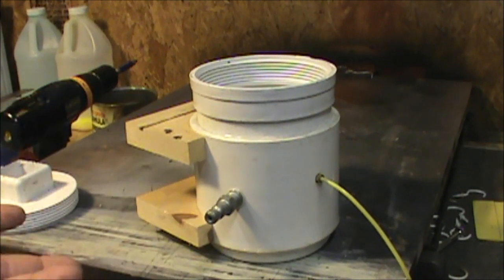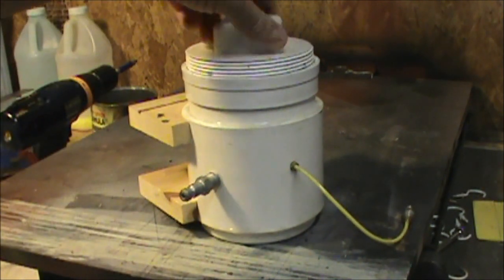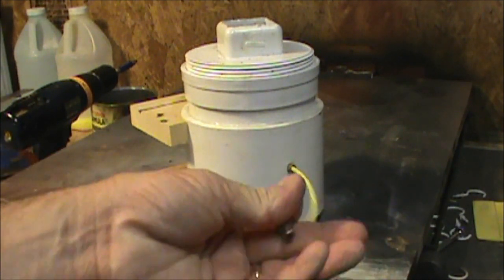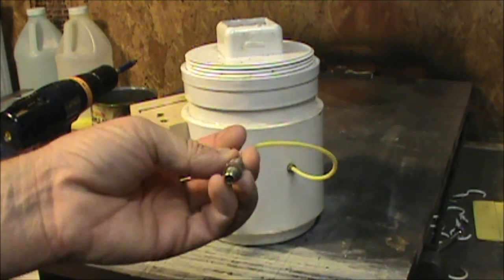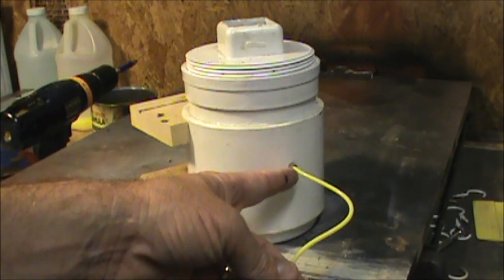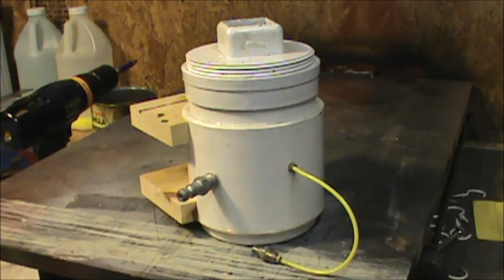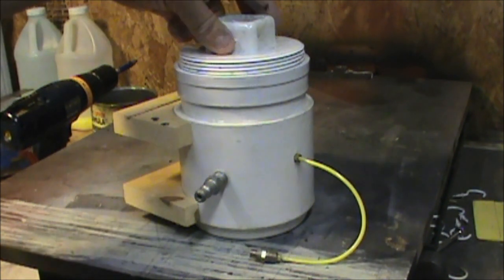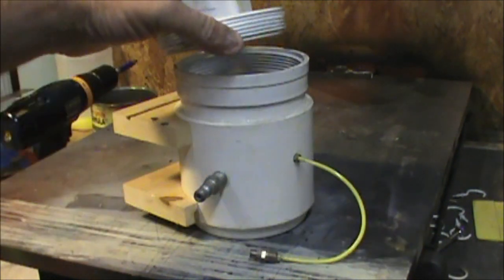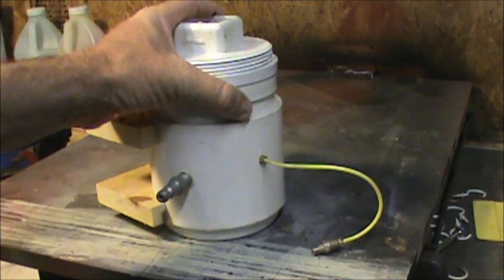This is one I've been using for about a year. It's just made with 4-inch PVC — it's a coupler — and I had a plug on one end. I'm using it as a degassing chamber with this connection hooked up to a vacuum, and I also use it under pressure with a small hose. I used to be into model airplanes and just drilled and tapped it — I think it's 6-32 — and I apply pressure from an air compressor. The max I'm using is 40 PSI. I even cut out the top and put a piece of Lexan in as a window so I can see inside. So far it's held up, but like everybody warns, be wary that PVC can fracture.